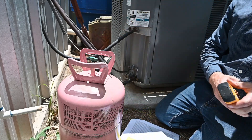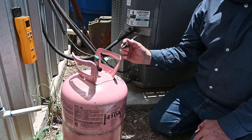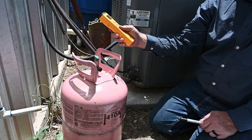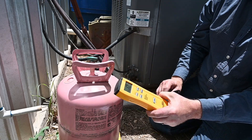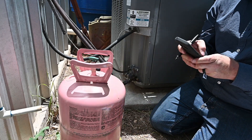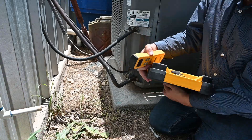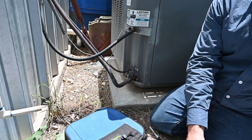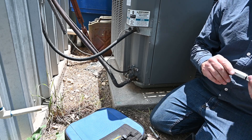Last thing I want to do is make a little note and add this to my refrigerant log book. I just make my log on my tank — I have a refrigerant log book to put these in later. I'm going to put one pound ten ounces and the notation of where it was used. I'm going to re-zero my tank: the tank and contents is 29 pounds 8 ounces. I'll write the new contents on here and add the date, so that if I forget to fill out my log book, I have it right here on the tank itself. There's much more that goes into checking the charge — this is our introductory basics. We had a system that was low in refrigerant, starved evaporator, starved condenser. We added refrigerant until the charge was balanced, and that's assuming airflow is good — this system does have good airflow, which was confirmed.